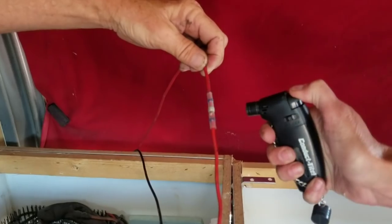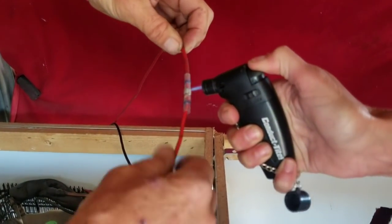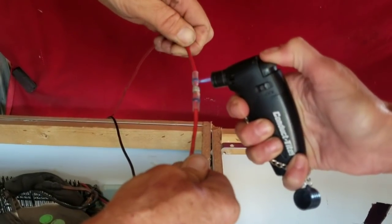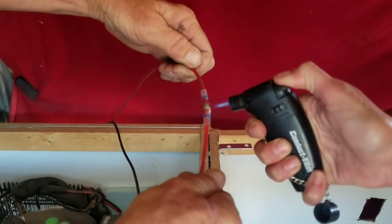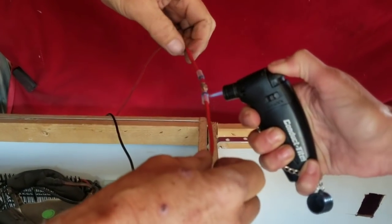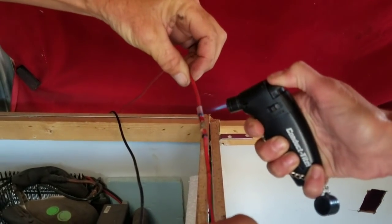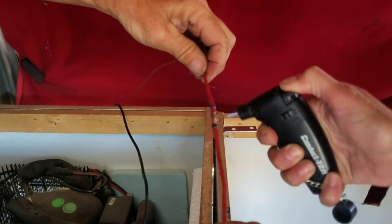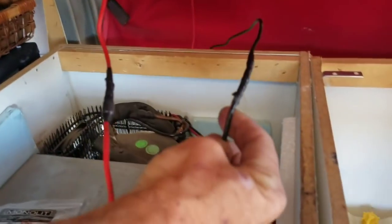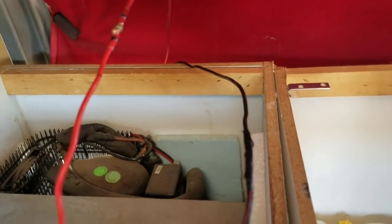So just fire? Yep. Go around a little bit. The solder is sealed. Now you go over the whole thing and shrink wrap it, and then it makes a watertight seal. Nothing gets in there and you're good — just let it cool. We did this one and we did these, and we just put electrician's tape over it just to make sure that you know there is a connection there.